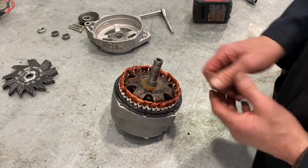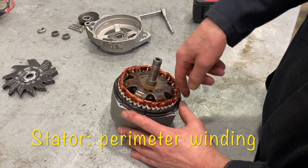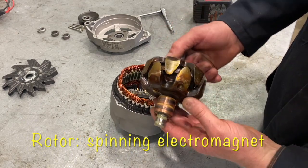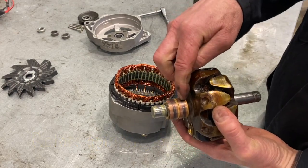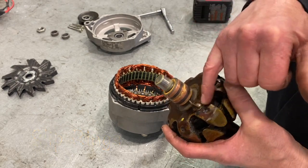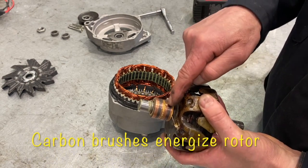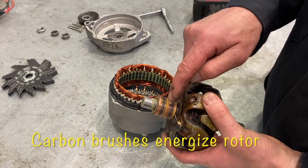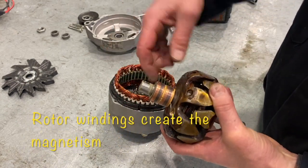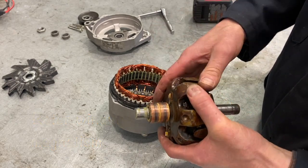It's a pretty simple system, actually. You've got a winding around the outside called a stator, and you have a rotor in the middle which acts as an electromagnet. We have two rings back here called slip rings, and each copper ring is attached to one end of a winding. The copper ring, which has power sent to it by a brush, sends its current through the interior winding, which is wrapped around the rotor many times. The other end of the winding, where it comes out, is joined to the other slip ring on the other side.